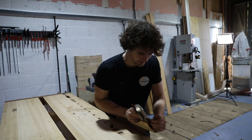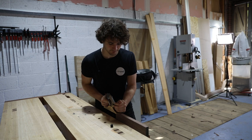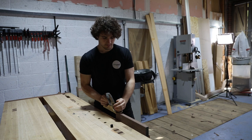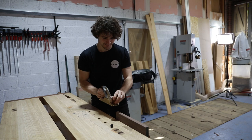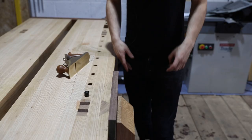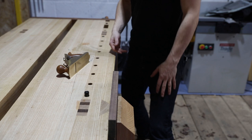You could just stand here and use your arms, but that's going to tire you out as well — if you've got a lot of planing to do, they're going to start aching. So use your legs to assist you, just carry it through the cut — you get so much control. And if you're working with a longer board, you could use both in conjunction: push your legs through as you're extending your arms. It's just a lot more enjoyable and you get a better flow, rocking back and forth as you're planing.